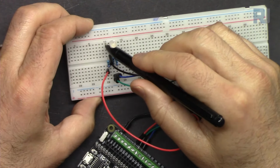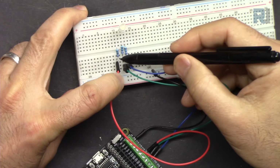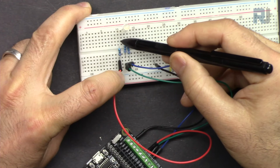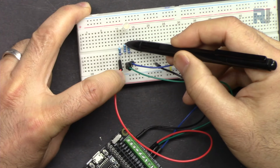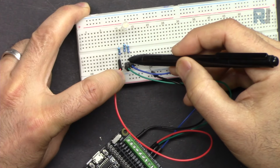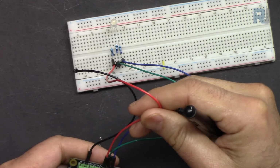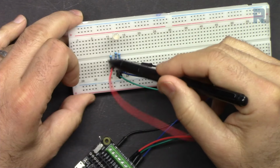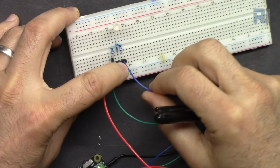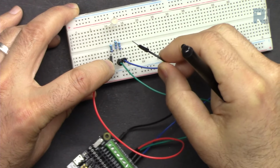From this point, I've connected a 220 ohm resistor, and then the common does not have anything, then the green has one 220 ohm resistor, and then the blue 220 ohm to this point, where the red is connected. The red is connected to pin 27, this is 26, and then the blue is 25. The one pin is not connected, it is connected to the ground,